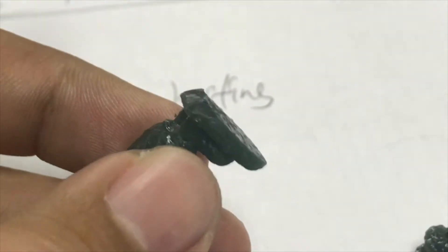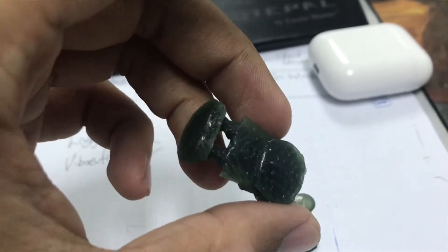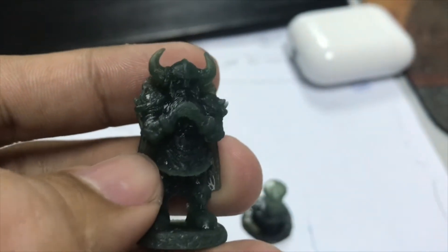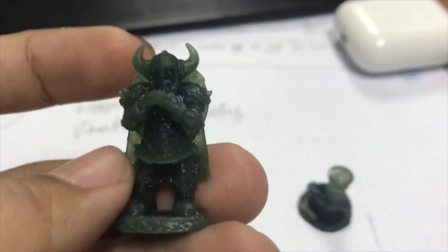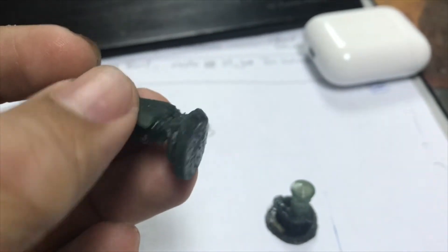The problem is due to the small pin of the support being too sticky to the FEP film or tank. When peeling up — the printer prints like this, lifting upward — the support just simply breaks off. But when it comes out, the support overall looks good; just that part is missing. You can leave me a comment to say whether this is good for you. I can tell that most DLP printers can achieve this level of detail, just with these same problems. This is not the first time I've faced this kind of issue.